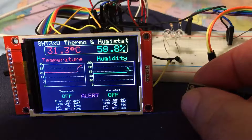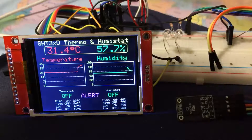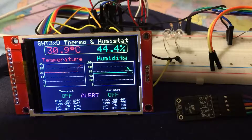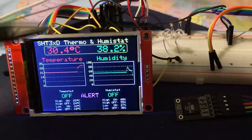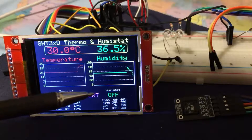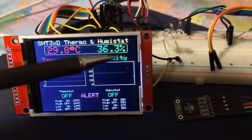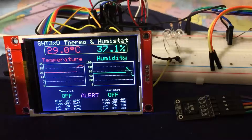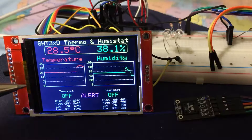The chip is very quick, so if I take my finger off the device you can see the humidity fall away very quickly. The green LED switches off because the off humidity value is 55%, and as soon as the humidity drops below 55% the demand for cooling or drying turns off.